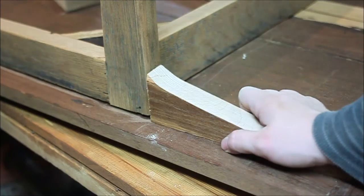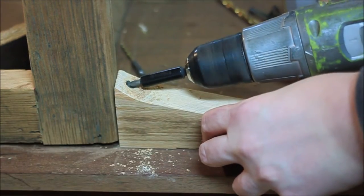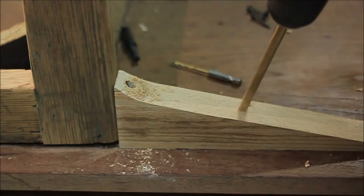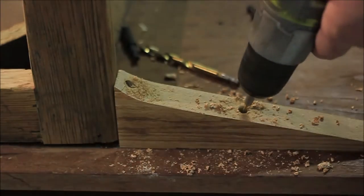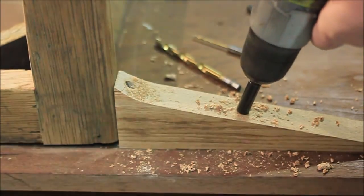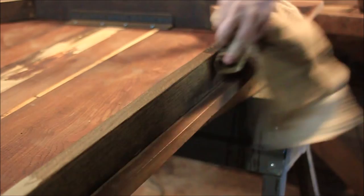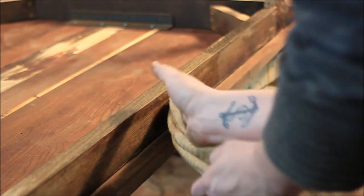Mmm, dusty. Really simple mounting method — just pre-drill some holes and get the nice sized screws in there. You'll notice there's a little gap at the top of the leg assembly there. I left a little bit of a kind of tenon on the top because I wasn't sure how the angle of the legs was going to play out against the surface of the table, and I was able to use it as a buffer to make sure everything was level without having to cut the legs over a hundred times.